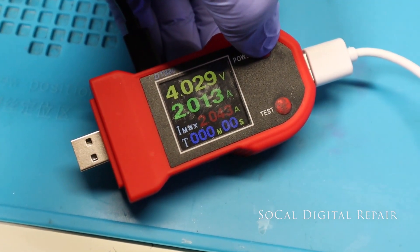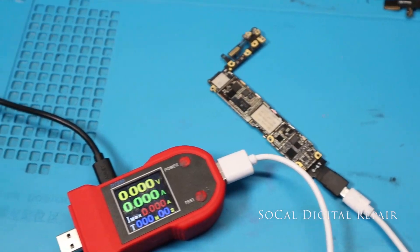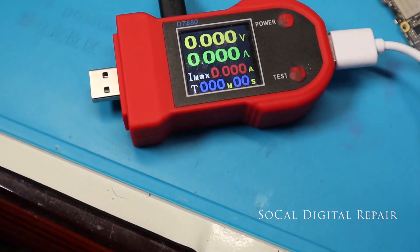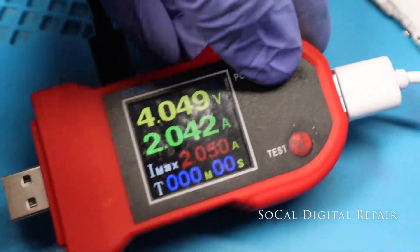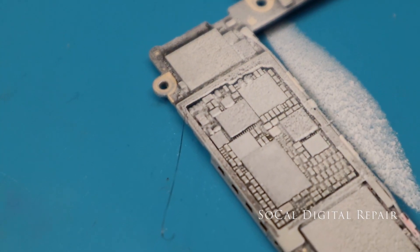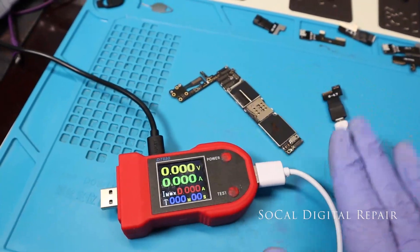You can see that is not normal. Let me show you what we can do with this tool. Using some compressed air, you spray it upside down on the logic board, and then you click power. Now we get the power draw, and then we can take a look to see what gets hot. There it is — the shorted capacitor.